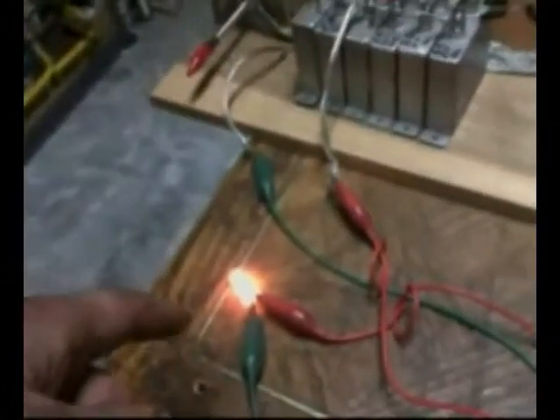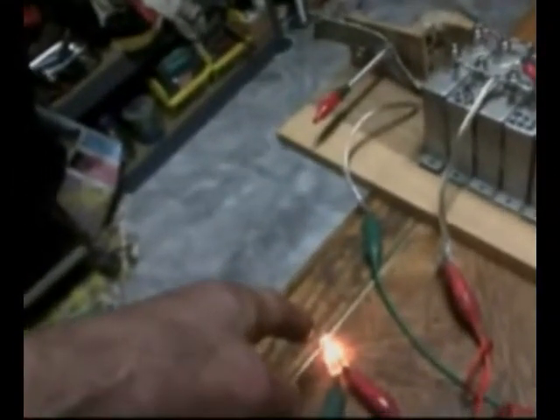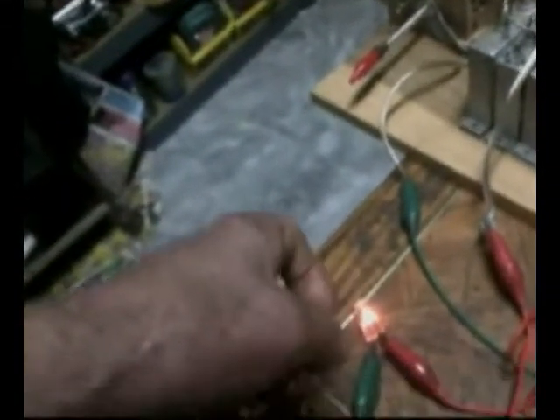As you've seen, there's 20-plus kilohertz flying through these bulbs at 600-something volts. The voltage and the current is where you're getting your light from. This is a 120-volt, 20-watt xenon bulb. It'll get brighter than that — I can crank it up. I've already blown out a 30 to 40 watt bulb cranking on this.